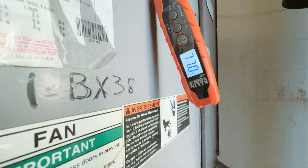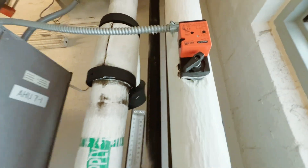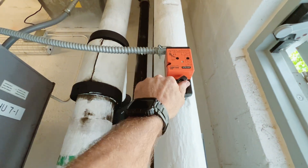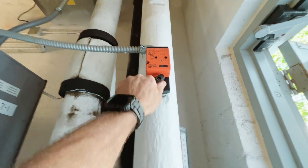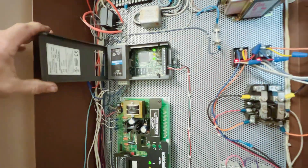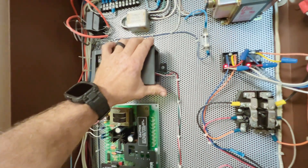Our supply is right about the same, so it's telling me that button looks like it's broken — that valve is probably closed. I'm going to call into energy management; they have to reload the controller because I was not getting any signals out of this. So we're waiting.